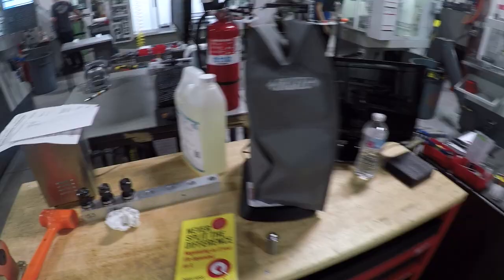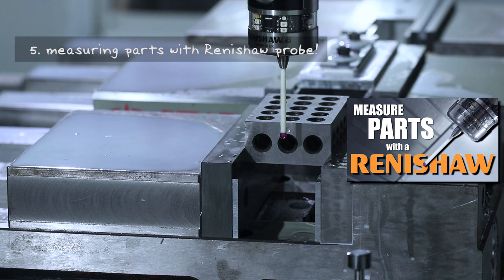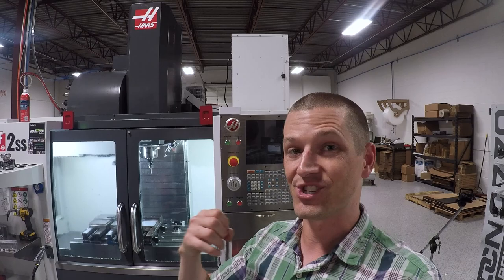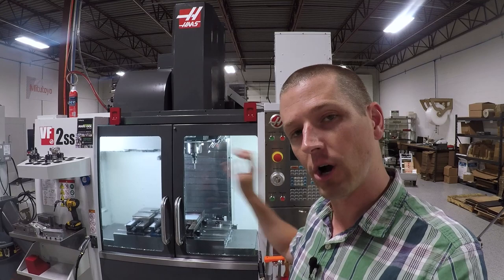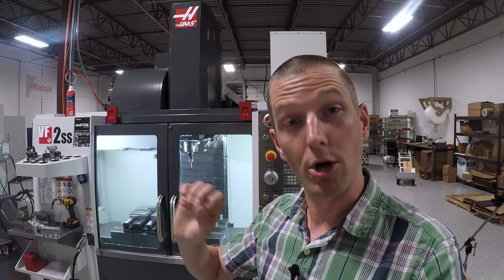I just finished a really cool probing video which Julie's editing. We figured out how to use a Fusion program plus the Renishaw probing system, where you pick two faces and it just gives you that value — so it's sort of like a CMM. These machines are incredibly accurate. The criticism could be you don't ever want to measure your part with the machine that made it — if you had error in your ball screw or the machine itself, that's going to be the blind leading the blind. Nevertheless, for a lot of things that we do, it's really nice to just pick two faces, hit go, and get that measurement or distance. So look for that on the NYC CNC website.